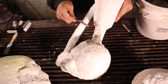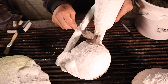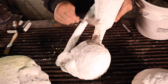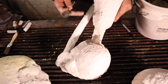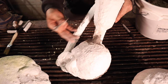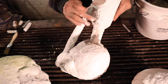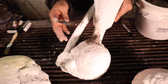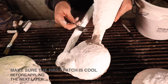An eighth inch to three-sixteenth inch thickness is your ideal thickness — maybe a little closer to a quarter inch just right around the patch or the hole for the micro vent. I never want my layers to be any thicker than a quarter of an inch, because anything thicker than that won't cure right. If I have a more extensive break and want a stronger patch, I'll apply this in layers — an initial application at three-sixteenths to a quarter inch thick, let that cure, and then do an additional patch on top if needed.